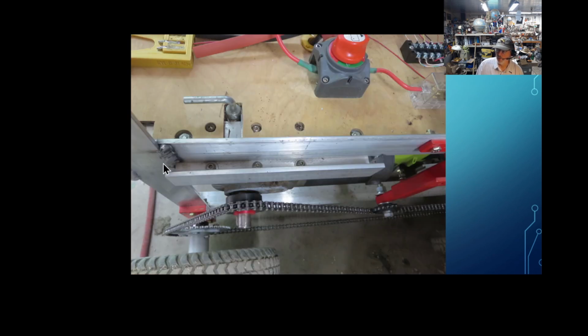How I attach my motors. What you're looking at here is a 2-inch by 4-inch piece of angle iron. The leg under the frame is 4 inches. I had to build that up by welding on another 2-inch section. These 3 bolts here go through the frame into the motor, because there's 6 bolts to hold the motor. These outer bolts actually just hold the angle iron I built, and then these 3 bolts here also go into the motor, but they are just supported by that outer frame. That works extremely well. I have no problem with this.